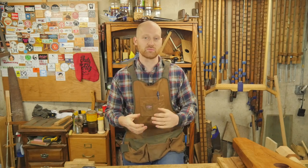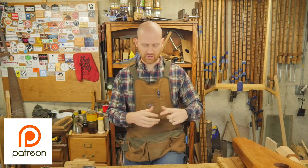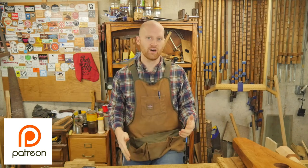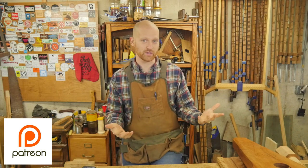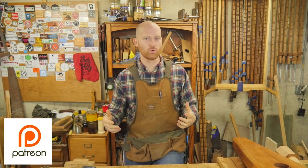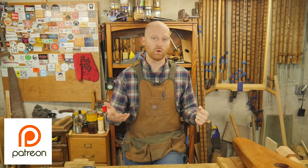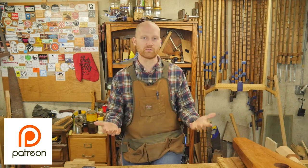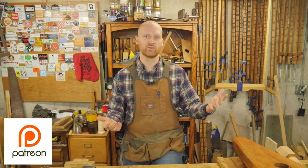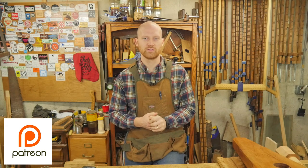This week's Patreon question of the week is from Travis Reese, who asked: when is it best to cut off a piece versus planing down to it? If you have a board and need to take off a quarter inch — is it quicker to saw it off or plane down to the line? For me, on an average board, if it's a quarter inch or more I'm going to cut it; if it's a quarter inch or less I'm going to plane it. The other consideration is whether you want to save that material — thin strips of an eighth inch can be valuable for inlay, especially with valuable wood.